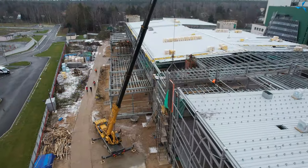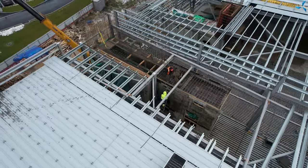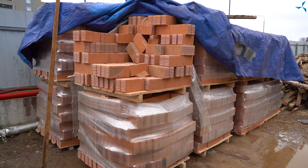You see the crane behind me. The crane is working with the flight of stairs. Detachable formwork is mounted in order to continue pouring concrete. And after this flight of stairs is poured, it will be possible to close the roof where the open space is left, and then we will be able to complete work on the roof. We also need to connect the roof to flights of stairs. The flights of stairs will be covered with the so-called soft roof. In order to do that we had to buy and bring bricks here — you see them behind me. The bricks are covered from rain, and then special elements will be made with those bricks in order to protect everything from precipitation.